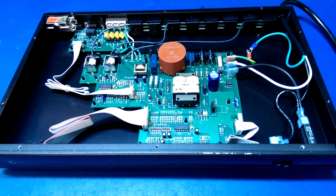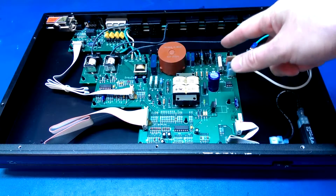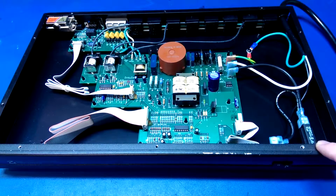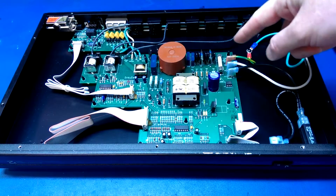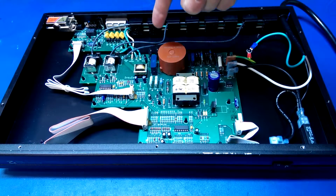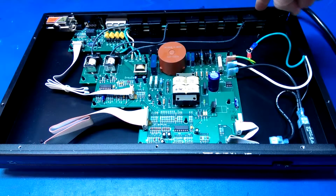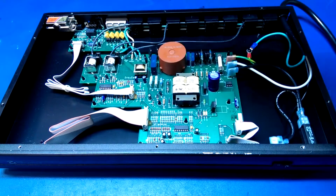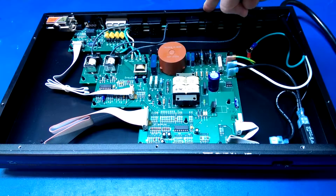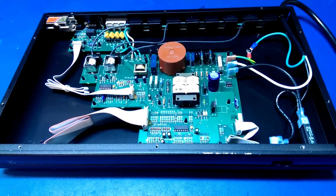Taking a look inside, it's pretty simple as expected, at least from the filtering side. You've got a handful of MOVs on the input along with a fuse. It feeds through a 15-amp circuit breaker on the front through the manual power switch, then through the fuse. You've got a nice big common mode choke, some filtering capacitors, and more MOVs on the output. Then there's a couple outputs — one to the fixed always-on outlets, and two big relays for the switched outlets and the delayed output, which is tied to the logic driven by the front DIP switches. The delay is adjustable from 6 to 20 seconds to power up your equipment in sequence.